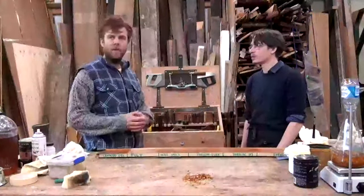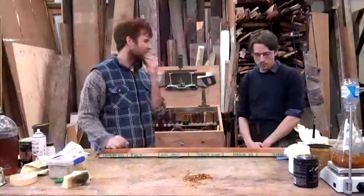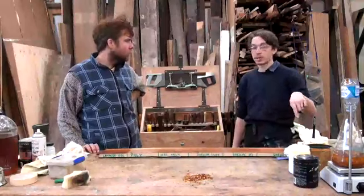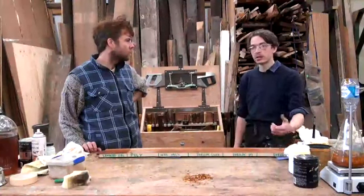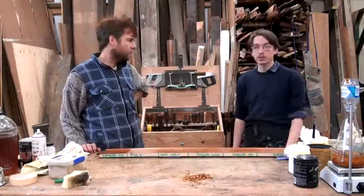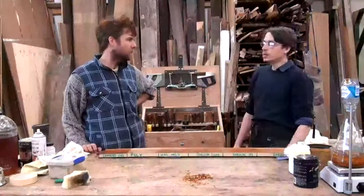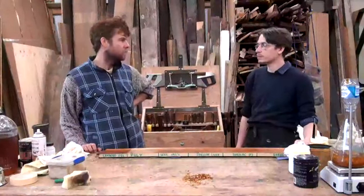What about a quick summary? We have 5 minutes to go, of how someone could determine what surface is on, say, their dining table. One of the quick ones: if you get a little bit of metho and put it in a small, inconspicuous spot and it goes tacky, that's a pretty good sign that it's shellac. That'll tell you pretty quickly if it's shellac or something that dissolves in alcohol, which will be treated the same way. Did they stop using shellac a lot in the 60s or something? It was still used pretty heavily up to about the 60s, but it's still used today.